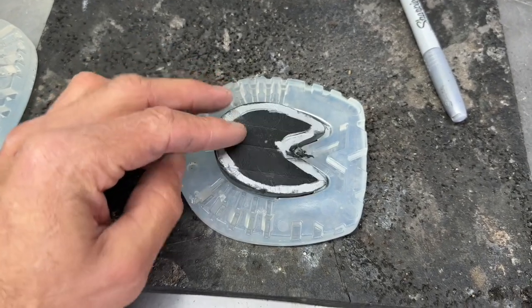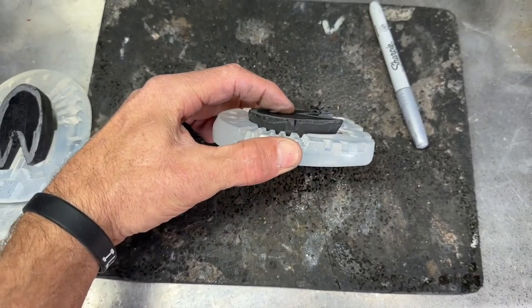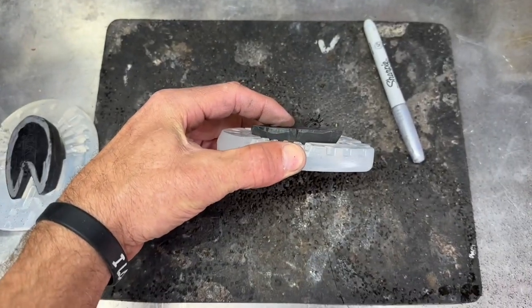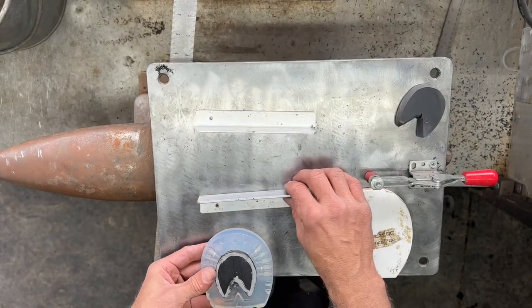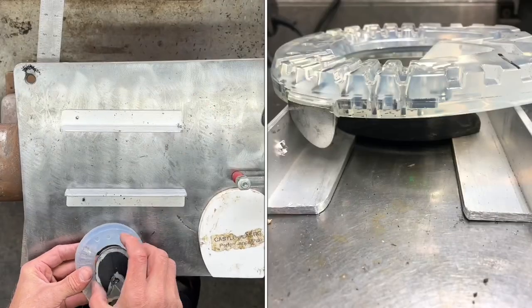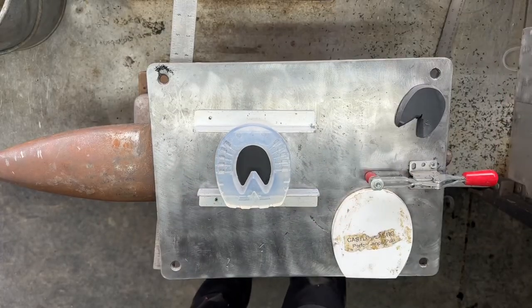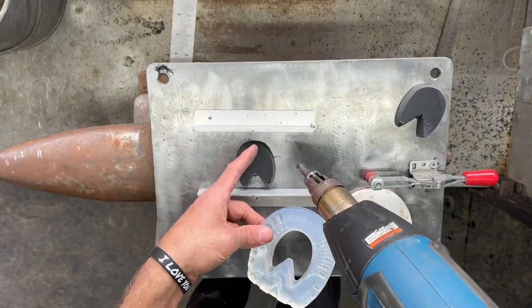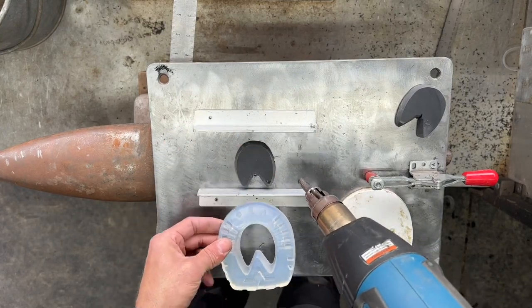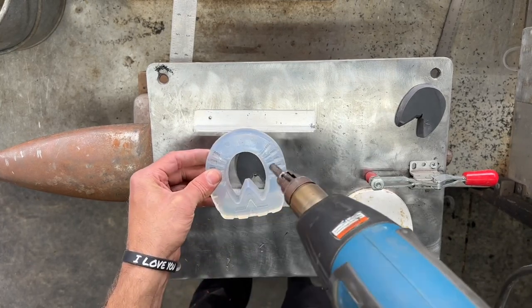So here we have our tapers on it. The goal is not to have it try to fit perfect — we can fix all the little imperfections once we've heated it up and welded it in. I'm going to walk you through the process first. You're going to want to have about a one-inch spacer to help hold your shoe above your plug. The reason I do this is while I'm heating up my shoe, the heat will radiate down and also heat up my plug a little bit. So I'll heat up the inner cup of my shoe, heat up my plug, heat up my shoe.